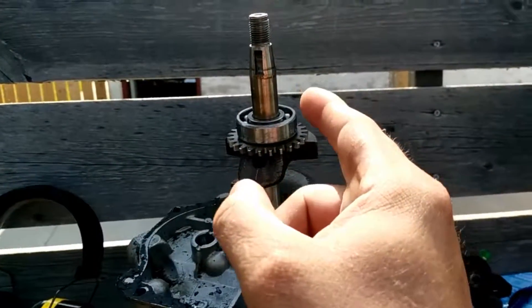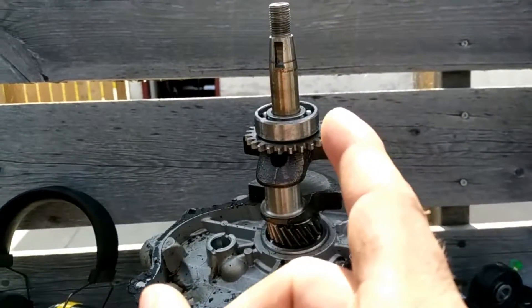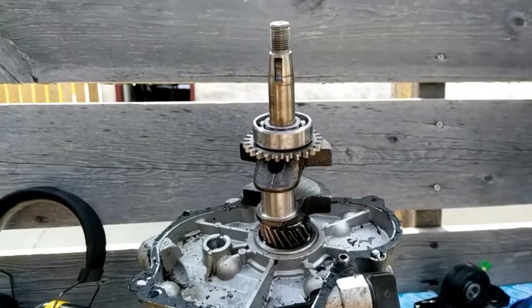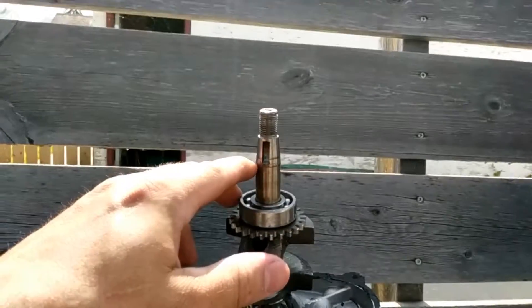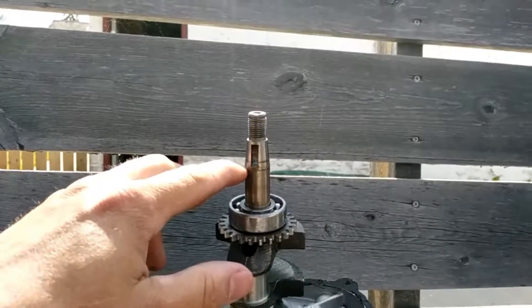This is 0.67 and that's 0.625 because it's 5/8. So I gotta take sandpaper and sand that down. I know, I said sanding — it's one of the worst things. All I gotta really do is bring down this piece here just enough; I don't have to do the full thing.